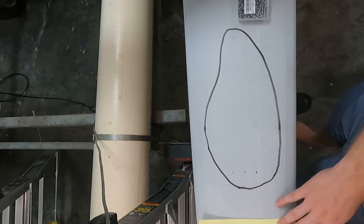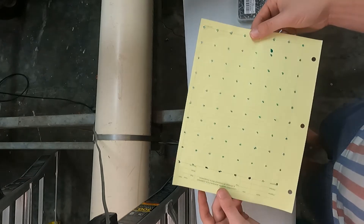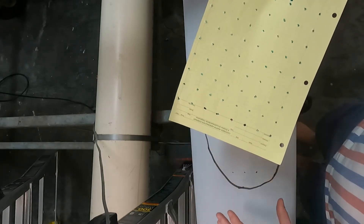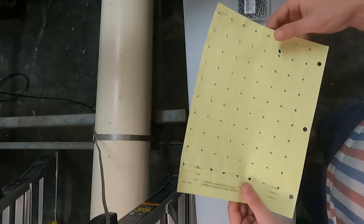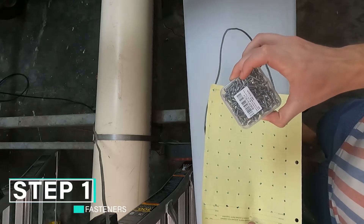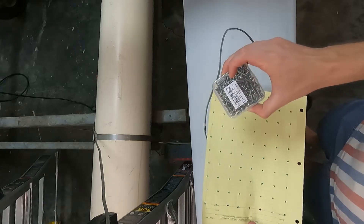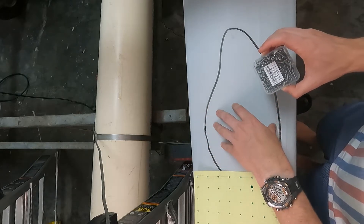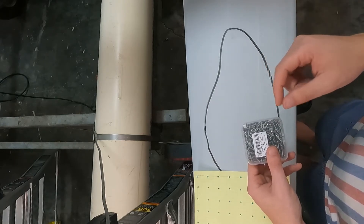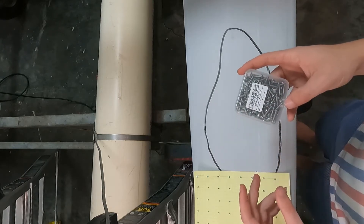To start out I need to drill all the holes to start injecting resin. I made a little one-by-one inch grid template. I don't think I'm going to put a fastener in every hole — just kind of around the edges and work my way in, maybe every other hole, so we can see good squeeze-out coming through. I only have a hundred fasteners and I've already coated them with PVA, which is a water-soluble mold release, so when we bond everything back together we can just run the fasteners out.